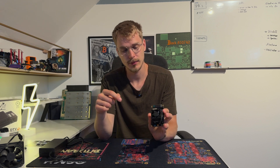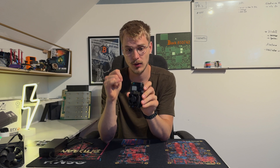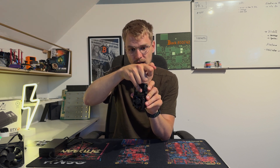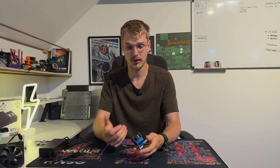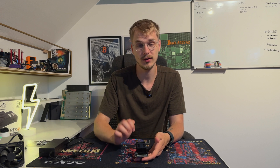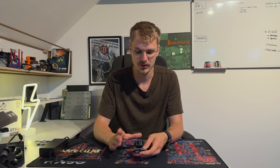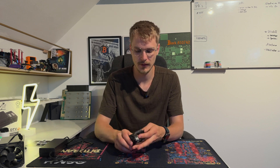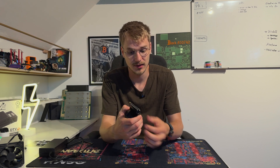I've seen some people put heat sinks in this area on the front as well. The reason is that if you look at the structure of the BitX, five volts are coming in here and traveling down this section, and also going to the other voltage for the ASIC chip. There is a lot of voltage and amperage going over this section, which is why plenty of people put heat sinks on the front of their BitX. I've not done so — I've seen it does improve cooling performance of those specific sections, but since I'm not excessively overclocking my device, I don't need it.